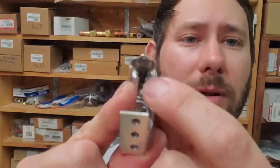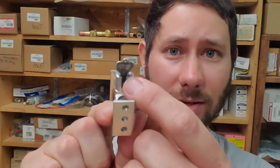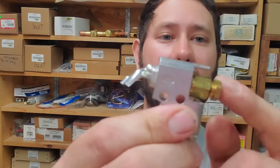There's a little tube in here, and it's called an orifice, okay? It's called a pilot orifice, and it's got a little bitty hole for that gas to shoot in there, because you don't want a bunch of gas coming in here. Anyways, this can become rusted over, so you might need to take this loose if you're not getting gas through this pilot tube assembly here.